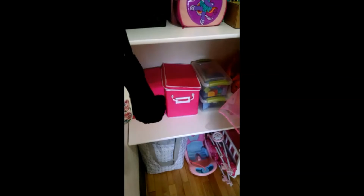And they came out even, I'd say, cleaner and really close, especially for the age of the home, than I was expecting. If you do end up having any gaps on the sides, you can finish that either with a quarter round molding, just the very thin semicircle, just a quarter of it, that you can put up there, or even just a bead of white caulk would be fine. Depends on the level of finish that you want for that closet.